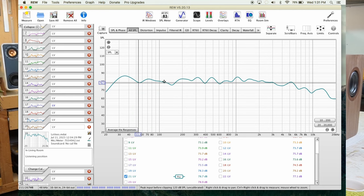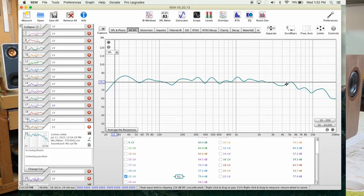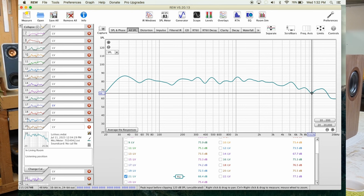And guess what? If we got an average here, I don't know. We have 26, 27 hertz inside of the room with those subwoofers. That's impressive, okay? So I'm happy with that already. The thing is, the highs are low. Why? Because we're far away from the full ranges and they are already shy on the highs. You can see that at 3, 4K, the highs start rolling off and we have highs going down a lot.